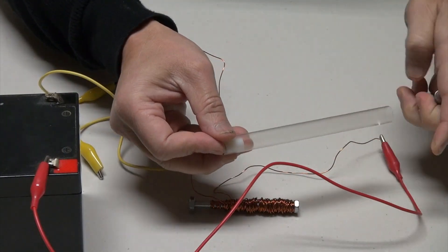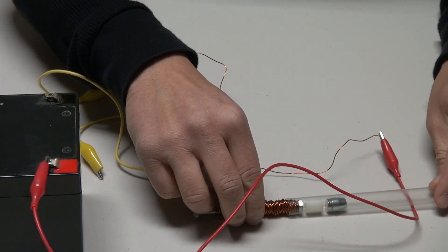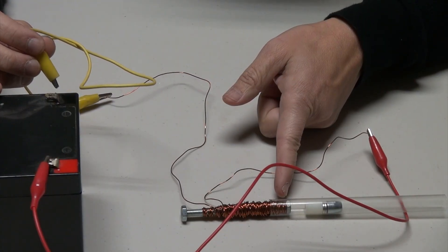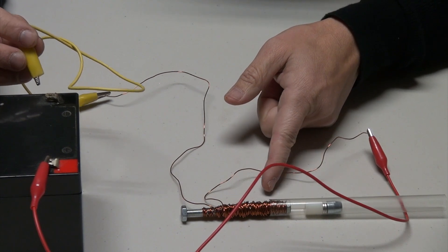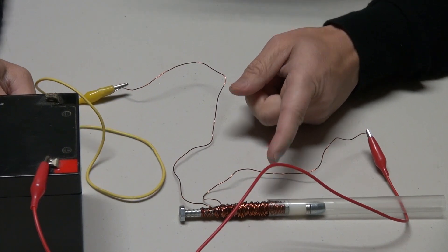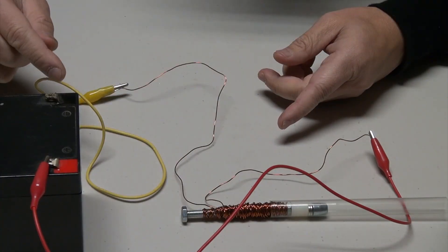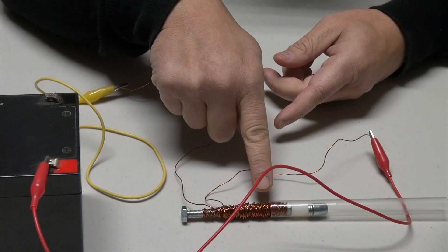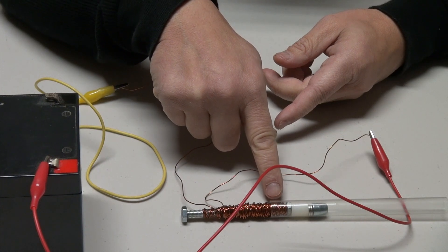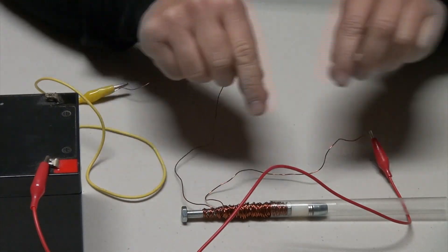I'm going to use this tube here. I put a little plastic insulator in there so the magnets don't automatically attach. I'm going to run current through it. If this end produces opposite magnetic poles to this one, it should attract it. When I run current through the wire, it produces the opposite magnetic pole. The other way to control this is by changing the direction of the current — when you change the direction, the magnetic pole of this electromagnet will also change, producing the same magnetic pole as this magnet, which will then repel it and push it outward.